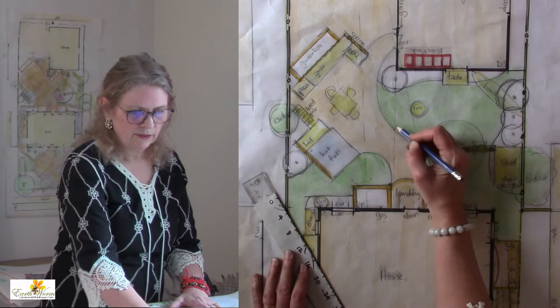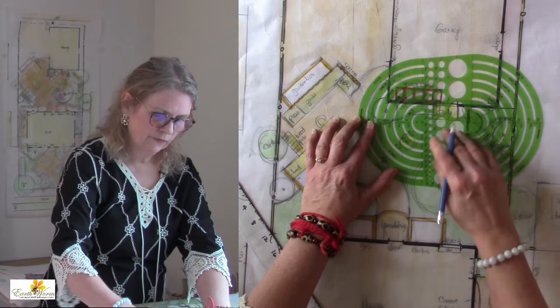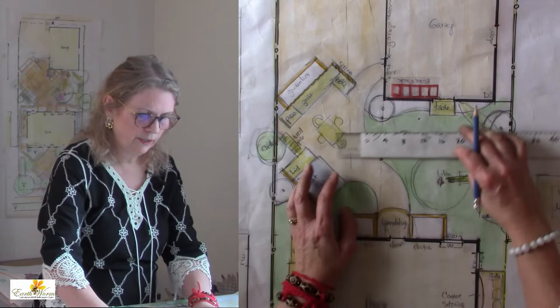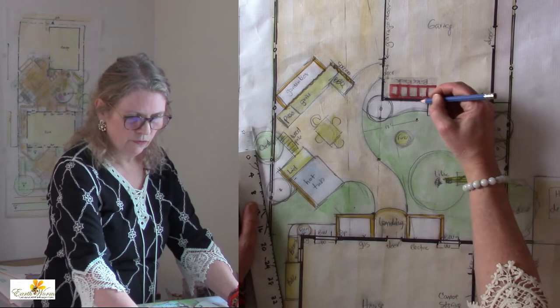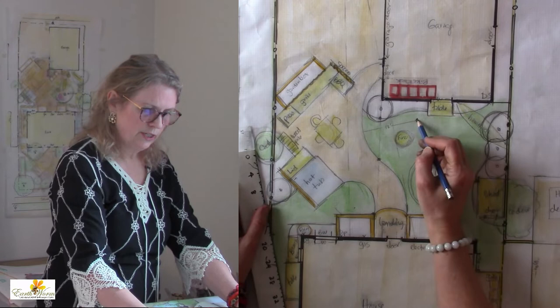So you will have a series of paint dots here, and then to get this curve, you once again put your circle template back onto your plan. You need a sharp pencil to do this, but you can find the center of the circle right here and plot the radius at 12 feet. We still have to find where this center dot is — it's about four feet from the wall of the garage and eight feet from the corner. So you'll measure over eight feet, out four, and then use the nail and tape measure technique to do a paint line.